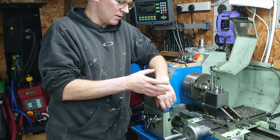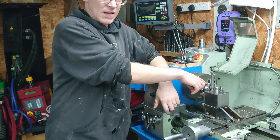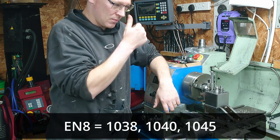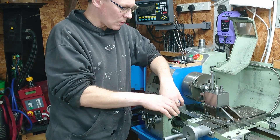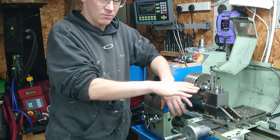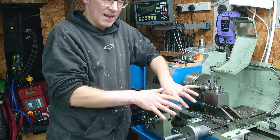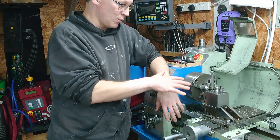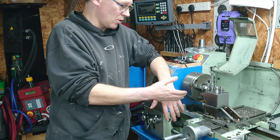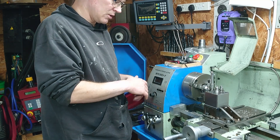It's all posted on the lathe and I think it's actually worse. Basically, when you take a cut in hard material — this is EN8 — the machine sort of vibrates and you get a lot of chatter. I thought that was because of the flex in the compound tool post, and especially when parting I could actually see the thing dipping. I'm starting to think now that the compound was almost damping out this vibration, because this rigid tool post seems to trigger that vibration a lot more easily than the previous setup did.